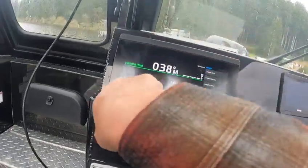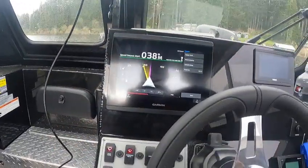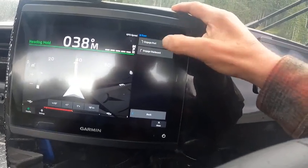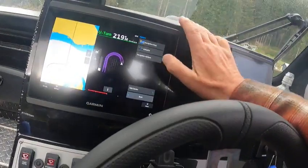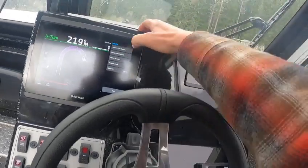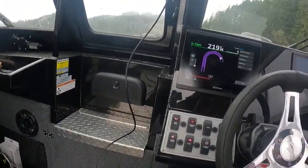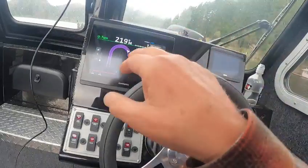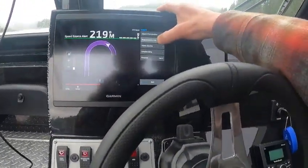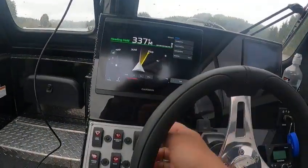So you can just hit there for speed. Now say I want to do a U-turn — I can go to pattern steering, U-turn, engage port. While I'm doing that I can hit the menu button again, go to navigation options, and back to autopilot. I'm in a U-turn right now. Say I don't want to complete it — I can do a U-turn or a circle to get headed where I want, then hit engage heading hold and it will hold me there.